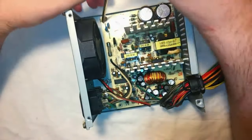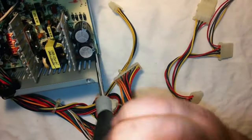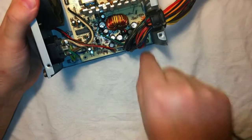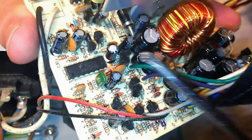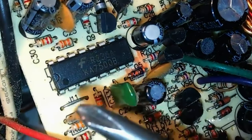To connect the battery, just change a few connections. If all goes well, there is no excessive sulfation and there are no mechanical problems. After about 24 hours, for a medium-sized car battery, a voltage at the poles of about 13.80 volts will be reached, which is the voltage of a fully charged battery.